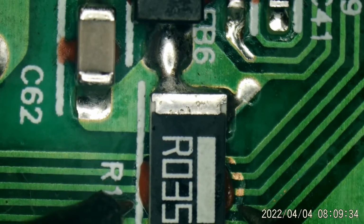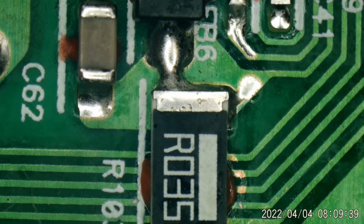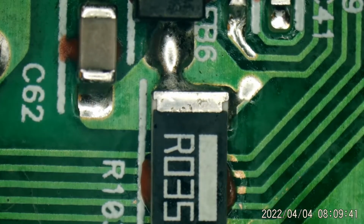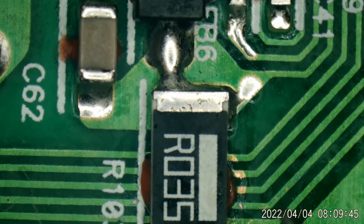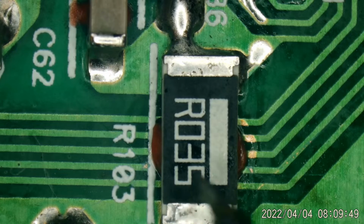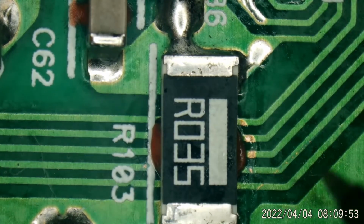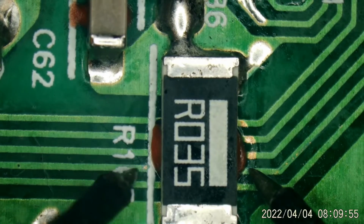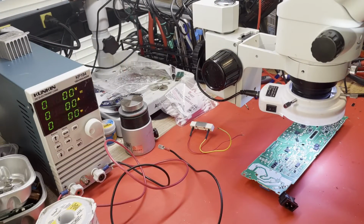Yeah, nothing. You may have seen in the video earlier, I was grinding this glue underneath away so this resistor would lay flat. I was using my little grinding pin, which is very handy. Well, apparently it's also really good for slashing a hole in the trace, because that had to have been what I've done. So I have no gate drive to the MOSFET that I just changed out. Let me see if I can fix that and see what happens.